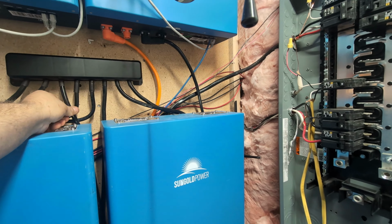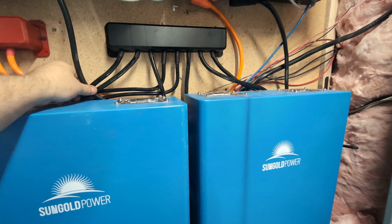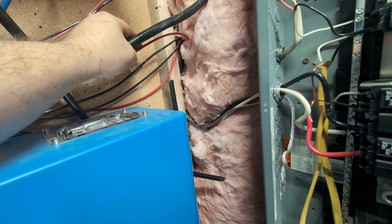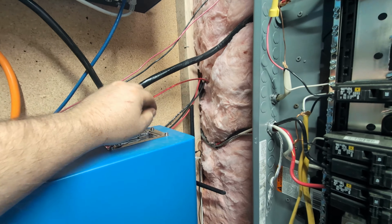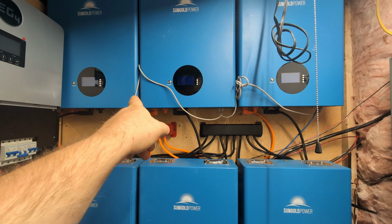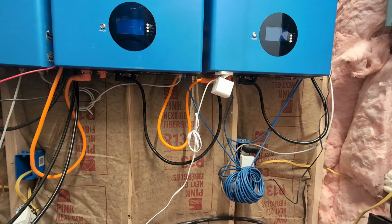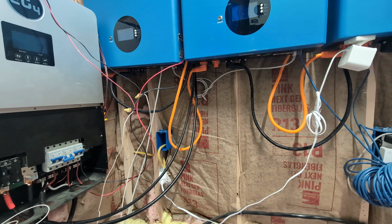Got those cables moved. I just pushed them down behind and just had the slack moved out the way. I don't really like how much that's being pushed up against the edge of it there, though. Need to... yeah, that's better. So these are the cables that come in for the photovoltaic. I want to get them all wrapped up together and push through better, but for now that works. These are the cables for the 2-wire start for the generator, but everything else looks quite a bit better. I need to get smaller cables for the communication between these batteries, but I mean, I can make my own, those pretty easy. I just haven't had the bother to do it yet. But yeah, every one of these has just one cable going into it now instead of all 4 ports being plugged up, so there's a lot more room here now.